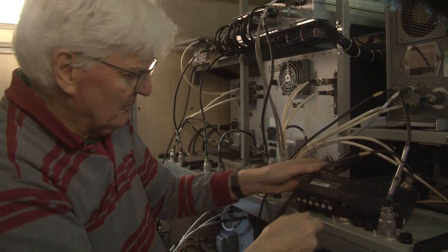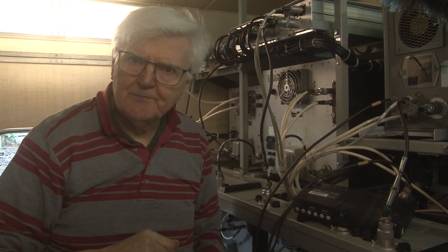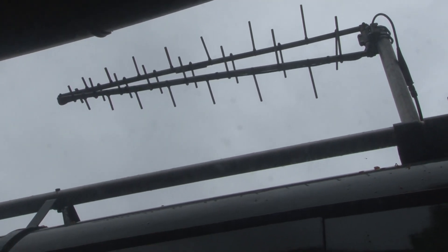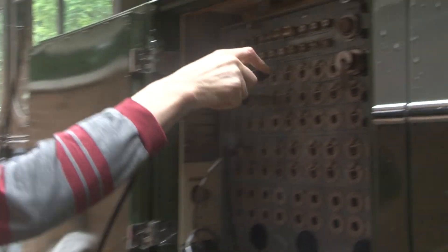The box seems to fit better upside down - I can operate it with a remote control. Our next task is to nip outside and connect the aerial to the technical tailboard, which comes through and ends up here. This is our log periodic aerial - the different lengths of the directors and reflectors give you a very wide bandwidth. That enables the van, when it moves to different locations, to accommodate transmitters on different frequencies.